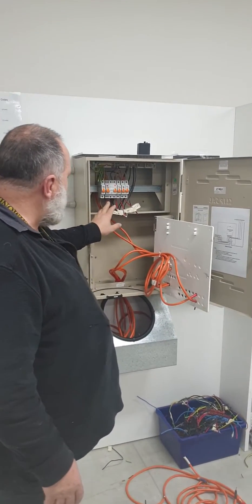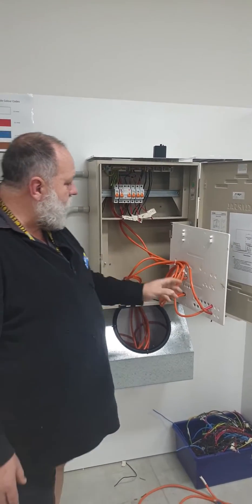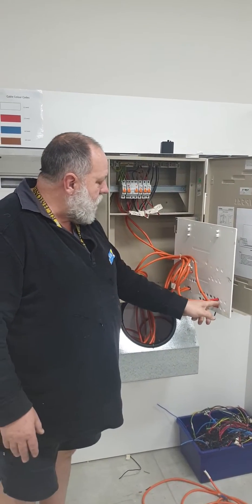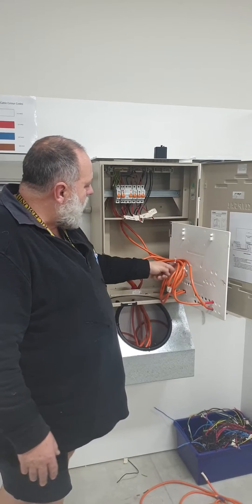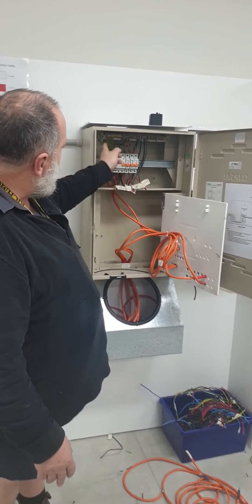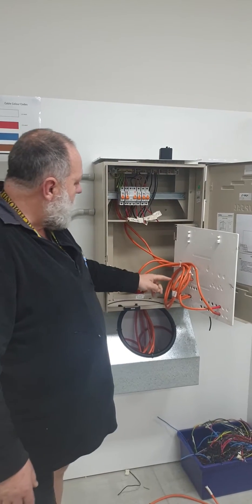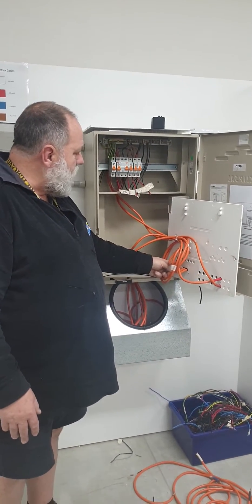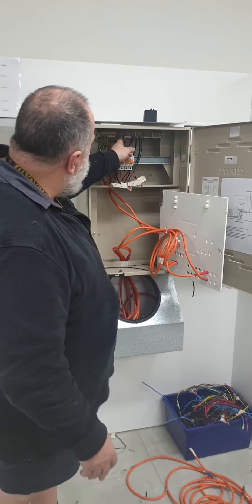The main thing we wanted to concentrate on are some of the things you need to know. We've got the wires coming into the fuse, coming up from the tail, coming across to the service fuse. From the service fuse they come into one side of the meter, and then from the other side of the meter they come back out up to the top of the main switch. The neutral comes in from the service pit into the bottom where the link is, and from the link comes up to the main neutral.